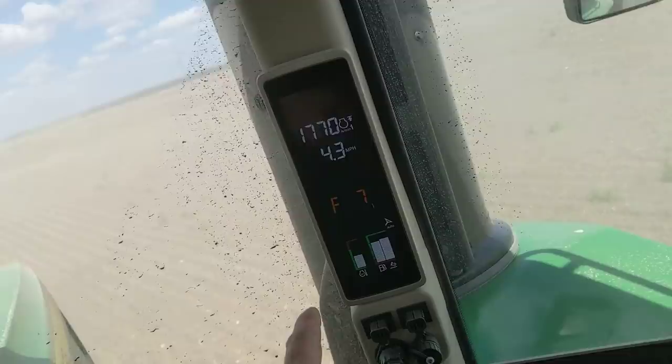Oh, and another, con number 8. We have 8 cons already. This thing burns a ridiculous amount of diesel and DEF. The diesel, I can understand. It's a Cummins, 15 liter. It's going to suck back a little bit. But DEF, I can't get one day out of that DEF tank. It takes 2 tanks of DEF for my fuel. 2 tanks of DEF. That's something I would expect in a Fendt, not a John Deere. Come on, John Deere. How long have you been building tractors for? Like 100 years? It might be somewhere. Seriously.